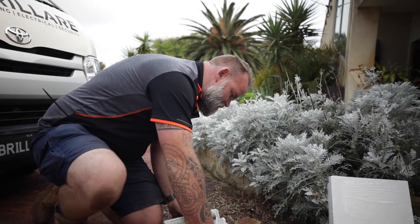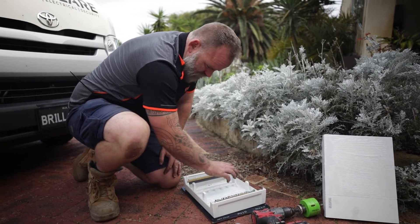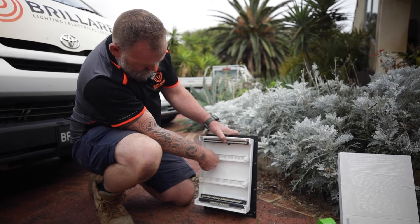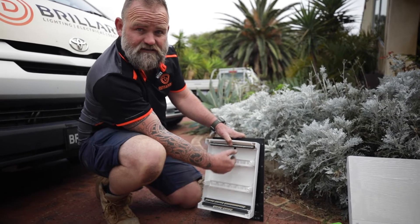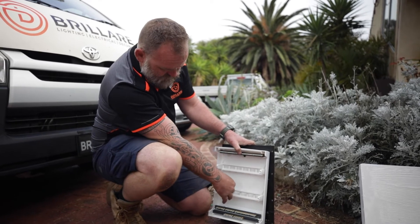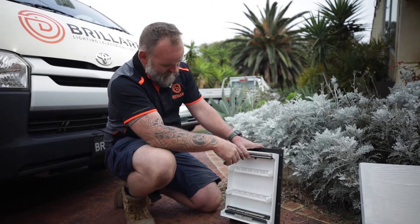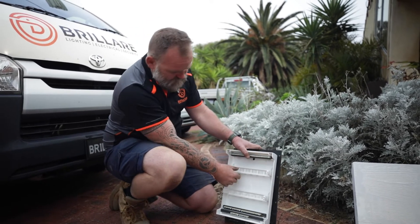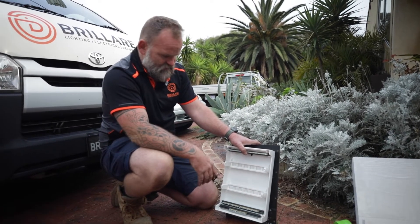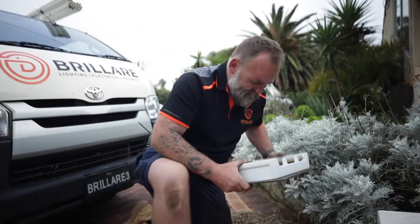So we're just making sure this will fit on nicely so I still have room to connect it to the actual enclosure. I'm going to drill a couple of holes here for the cables to come through, then mount our breakers and everything on here. Ideally we'll have the main switch up top, then higher circuits to lower - main switch, solar, any heavy drawers, ovens, hot plates, then powers, ACs, and then lights at the end. The normal person doesn't really have to touch a switchboard - only if your RCD trips. Then you can come out and reset it. The beauty of these new RCBOs is that just the individual circuit will turn off - you won't lose a bulk of the house. If it still trips, that's when you call an electrician.